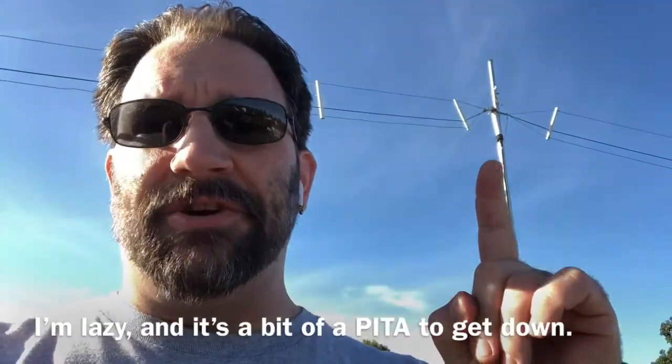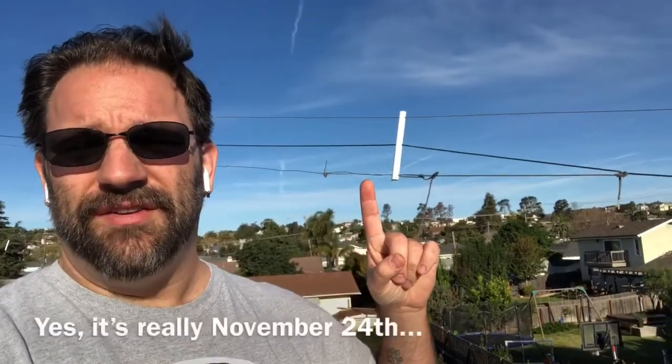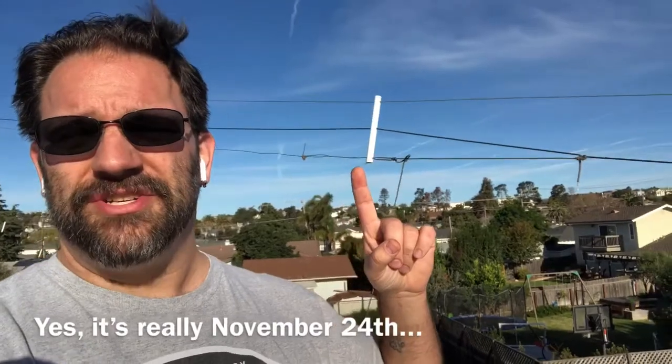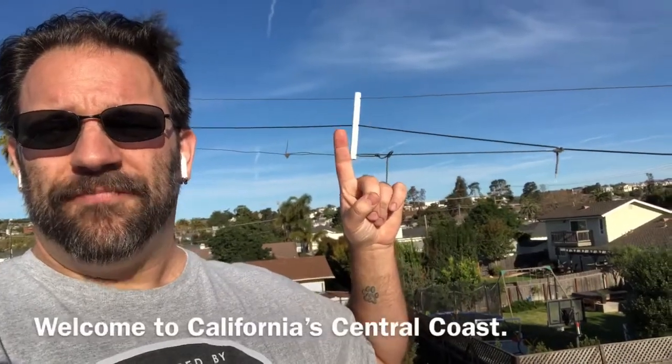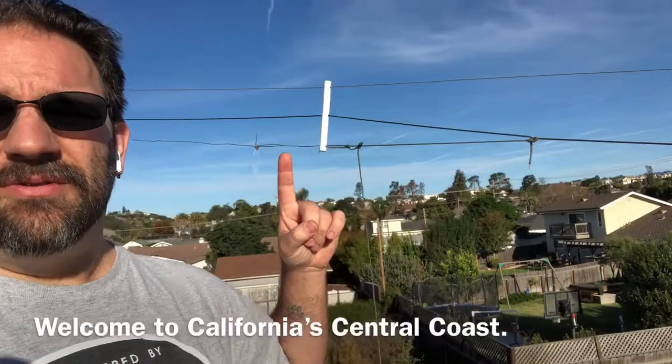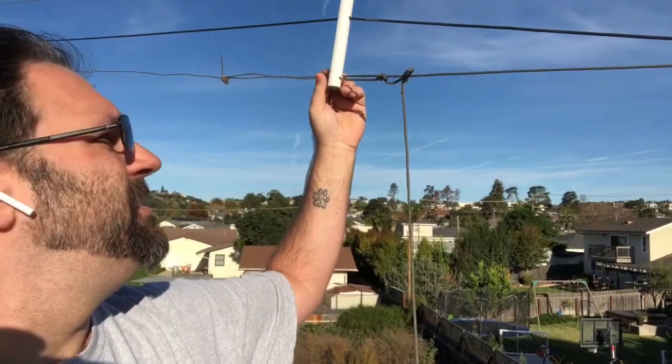The separators here are just simple lightweight PVC pipe with some holes drilled in it. Let's take a look at what one of the joins looks like. This bottom wire here is my 30 meter section — that's the shortest one. It used to be a 40 meter section but I cut it too short; it would never tune down to the bottom end of the 40 meter band. So I turned it into a 30 meter section and ran another longer wire — this black one in the middle — as the 40 meter section.